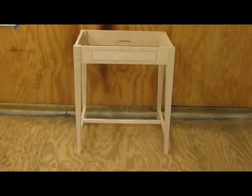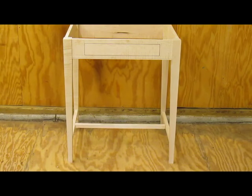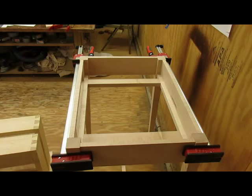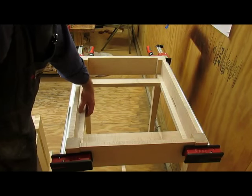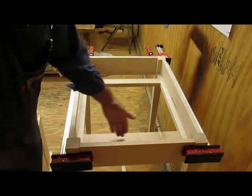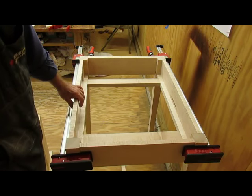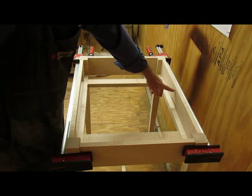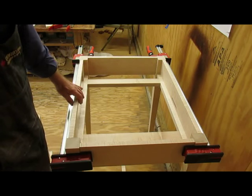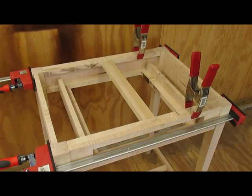This is how it currently looks assembled — not too bad, I like it pretty well. But now I've got to put in mortises for the drawer runners for the one central drawer. I built a small frame here for the drawer runners — the runners themselves are mortised into this front and back rail. I've got to put in vertical pieces to guide the drawer, and then we'll probably need a kicker across the top to keep the drawer from tilting upward.